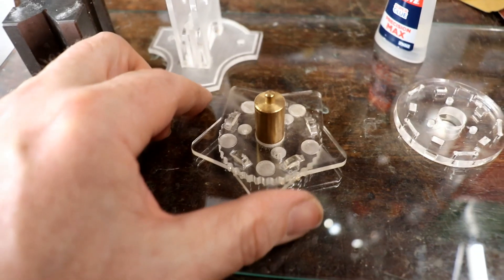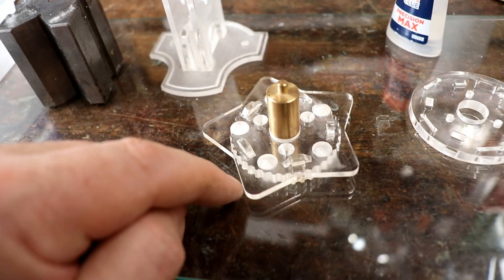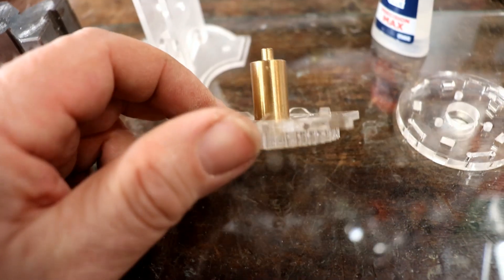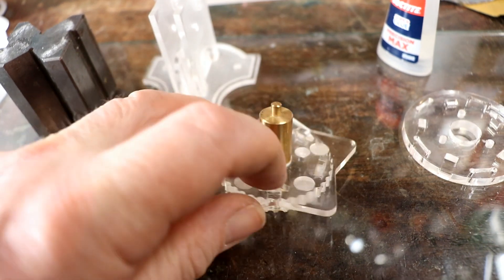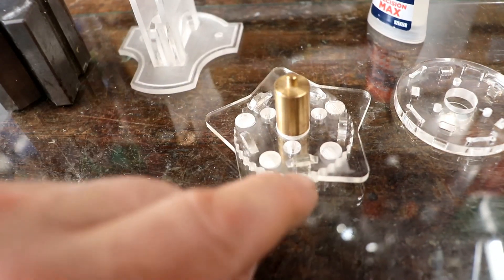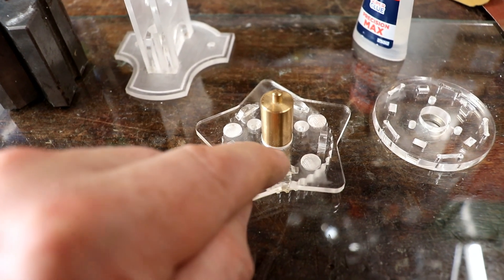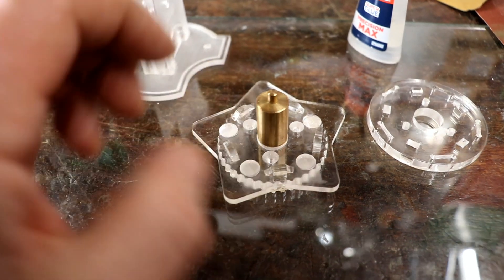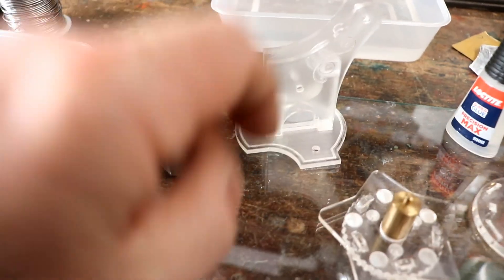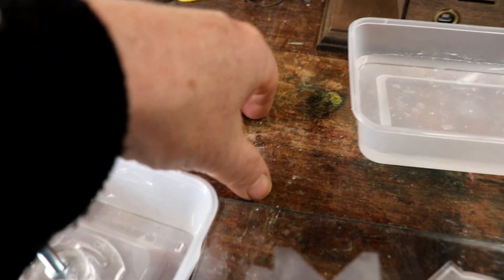It is so delightful when a purely functional design ends up looking really interesting, like this. It's got two lots of cams: one is horizontal — the star shape — that lifts the hammer back and primes it. And around the centre there are five other little vertical cams that lift the hammer catch out of the way and let the hammer fall back down. There are little slots for the elastic that support each chime. So as this comes round, regardless of direction, as the cam passes underneath the catch it lifts it up and the hammer can drop back and hit the chime suspended from there. The other good thing about using glass is super glue doesn't stick to it very well, so you don't have to worry about accidentally gluing your work to your surface.